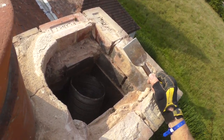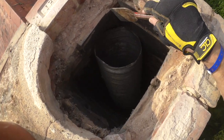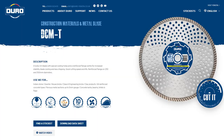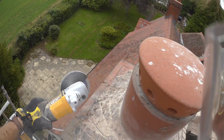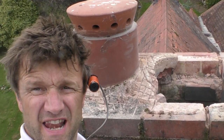I brought the new chimney pot up to see how it was looking and had some ideas about how to fill the gap. I decided to score the surface of the old cement render to give the new layer a good bond to the old, using one of these Duro DCMT blades which I find much more durable than standard grinder discs. Then it was a quick blast with the leaf blower to remove all the dust.